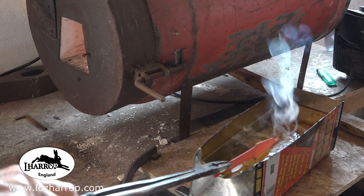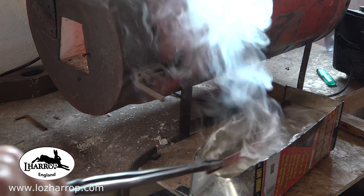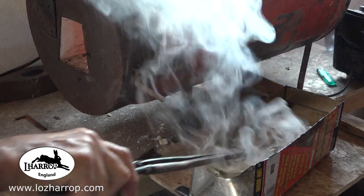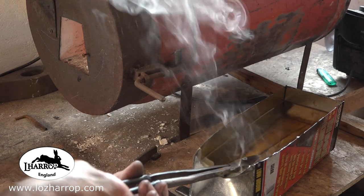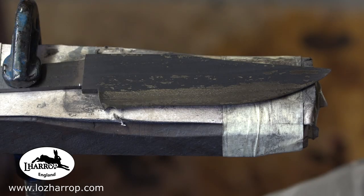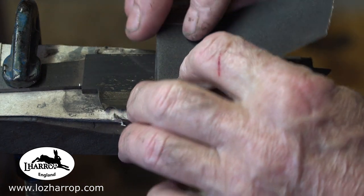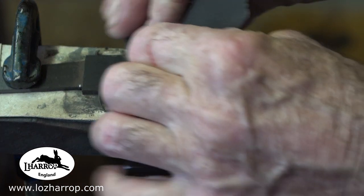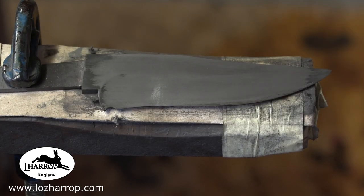And I went at 795 degrees centigrade for 15 minutes. And then this is in Parks 50. I just wanted to test it, just to make sure how strong the welds were, because if it's going to break up, it will do in the quench or it'll warp. But it was thermal cycled and it came out fantastic. Good hardness, 65 Rockwell it came out.